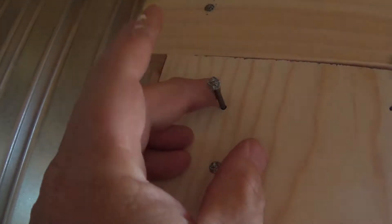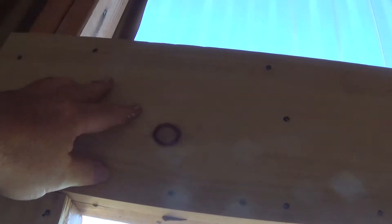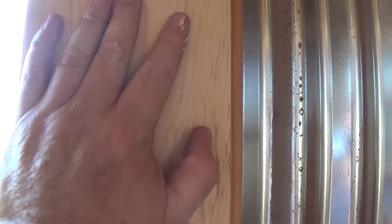Let's take a look at the inside of the door. Here's my one-by-six — you can see this piece here started to bend on me so I'll just let it be. This is a one-by-eight. The reason I did this was not only to give this two-by-two something to connect to, but also to give more of a clean finish on the inside. Over here it's the same thing — a one-by-six — with lots of glue.